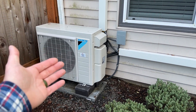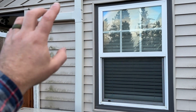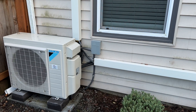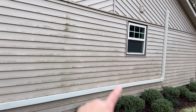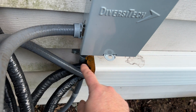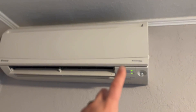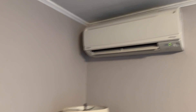In case you're unfamiliar with how a ductless mini split works: we have our compressor and fan out here just like a regular system, and the head unit on the inside is powered from the outdoor unit. We bring 220-volt power — in some cases you can get a 110-volt system — into the box here, and the condenser distributes power to each head unit. For each unit you have two refrigerant lines: one pushing refrigerant into the coil and one pulling it back out. This allows a cool coil in summer and a hot coil in winter. The indoor unit only needs 110 volts to power the blower wheel; the rest is just refrigerant circulating through the coil.